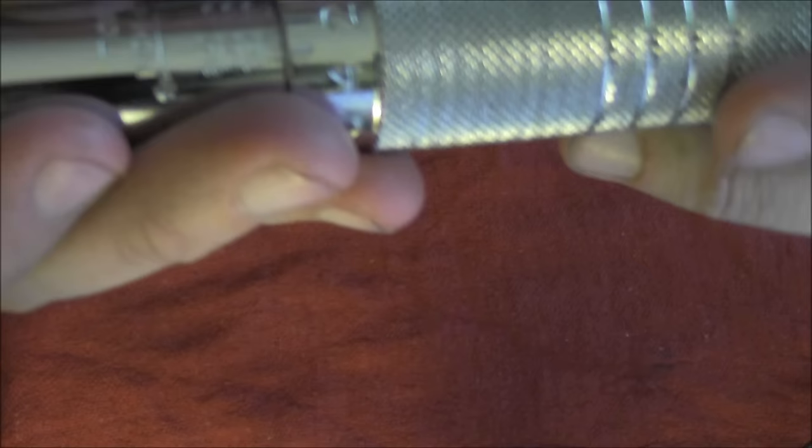So we have this lock right here. I turn it counterclockwise to loosen it up, and then you have a couple of settings. We have inch-pounds on this side, and on the other side we have it in Newton meters. We're not from England or Europe, so we're going to stick with the inch-pounds. I'm going to go ahead and set this to zero. Now we are in inch-pounds and we have torqued it out to zero.